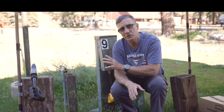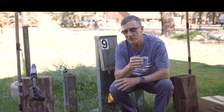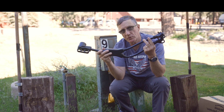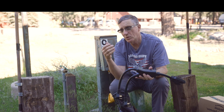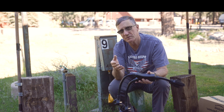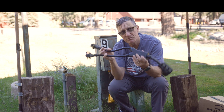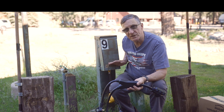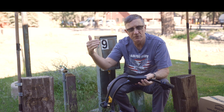Even with dual 30 amp, I'd encourage you to manage your loads — keep maybe two air conditioners disabled to spread energy more uniformly. Always leave yourself a margin of error. With a dual 30 amp to 50 amp connector you get 7,200 watts. A true 50 amp service gives you 12,000 watts — 100 amps times 120 volts. So: 3,600 watts on a single 30 amp, 7,200 on a dual 30 amp, and 12,000 on a true 50 amp.